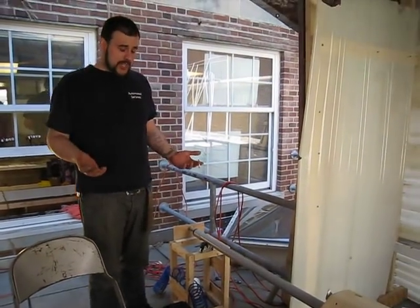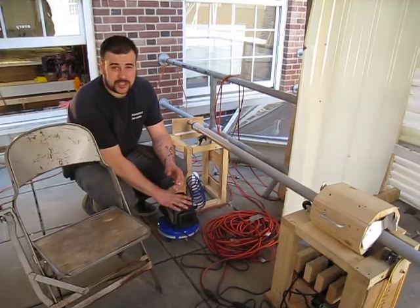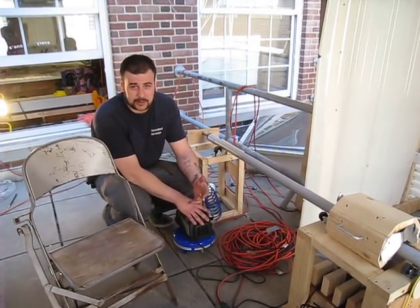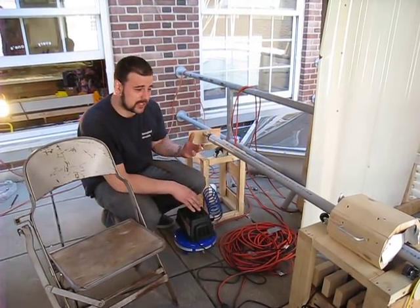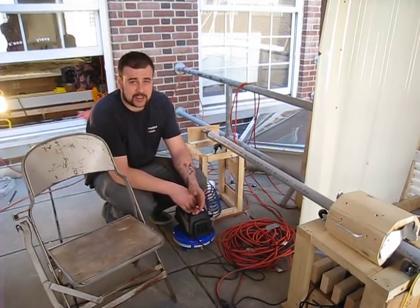When you're about ready to bend, what you want to do is pressurize your tank. The pressure you set it at is going to vary based on your tank size, unless you have a regulator — if so, set it at about half a bar. What we do is pressurize the tank to 20 psi, and by the time we release that pressure into the pipe, it cuts down to about 7 psi, or half a bar.